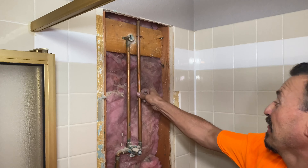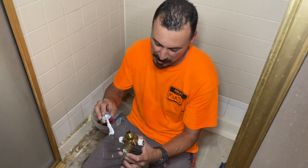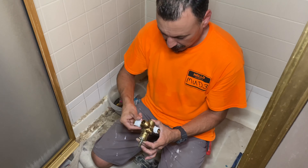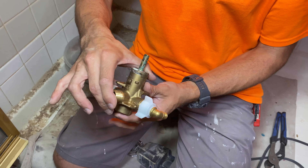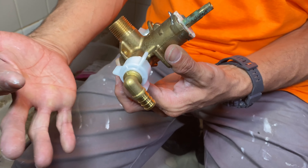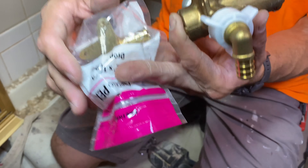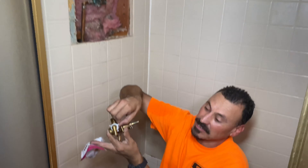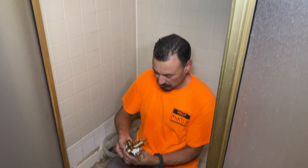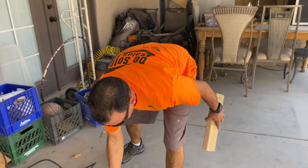They're applying pipe sealant — normally called pipe dope — which seals the threads when everything is screwed together. Out with the old, in with the new. These are fittings that interchange with PEX pipe, since everything's gone to plastic now. Going from copper to new PEX requires changing the fittings, and instead of welding, these SharkBite-style push fittings are easier, faster, and more efficient.